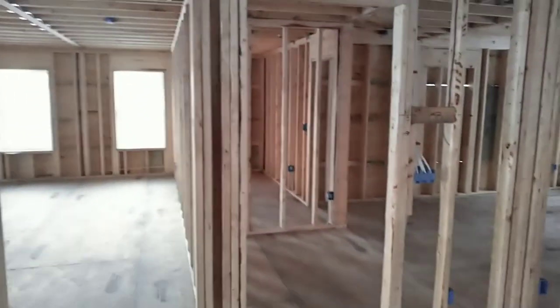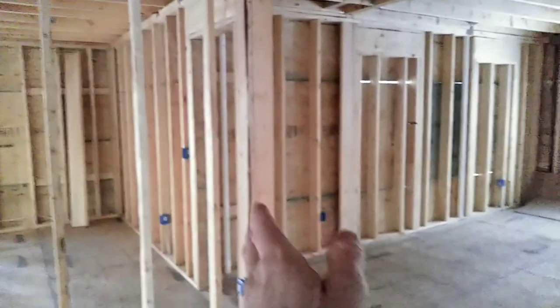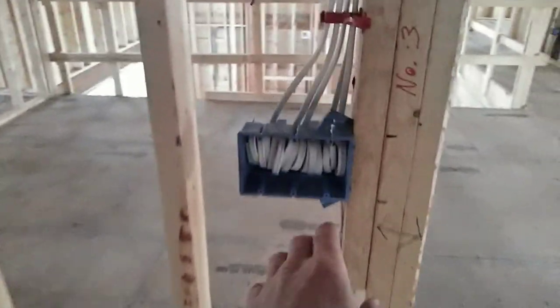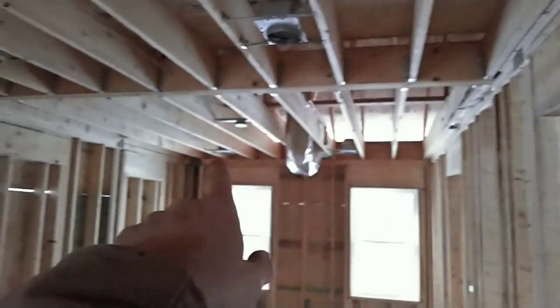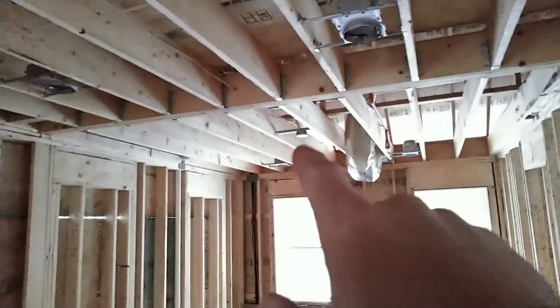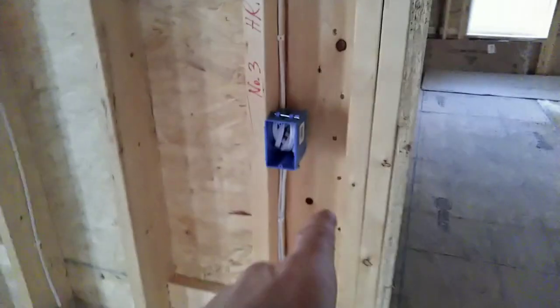This doorway is the master bedroom. He's got an overhead light right here — this master bedroom area is smaller, so that light covers this section. Three-gang switch box: first switch is for this smaller area, second switch is for four perimeter ceiling cans — one there, there, there, and there — and the third switch is for the center fan. He's doing remote controls on pretty much every fan in the house. This is the master closet — he opted for two lights, one there and one there, switched from this location.